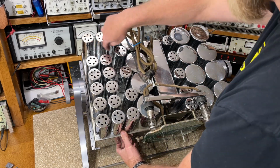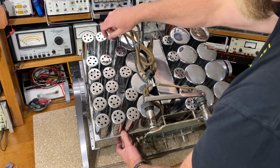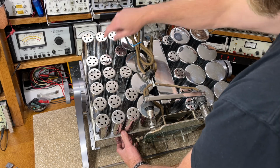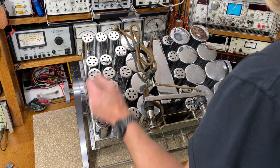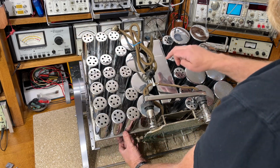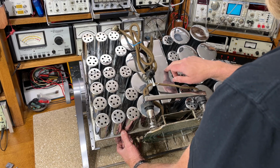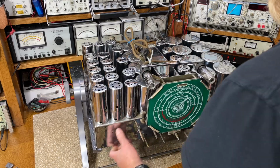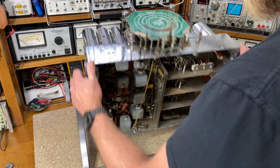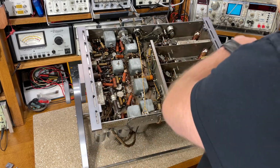And then there's a base choke box here that's off on this set. I have it on the side, but there are 4 capacitors there that get replaced, so that needs to be removed and taken apart. And then the tuning capacitor cover here comes off, and there are some paper capacitors and some resistors in there. And it's good to have ready access without having to flip the whole thing over.